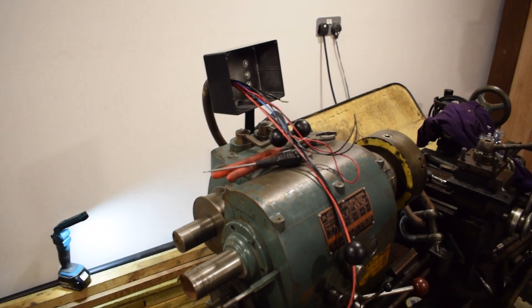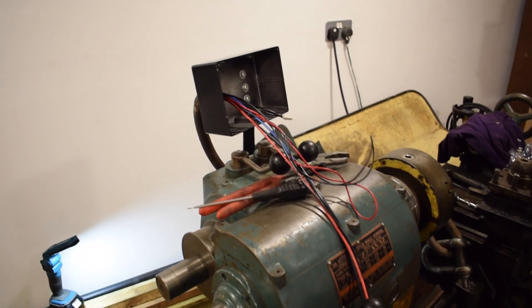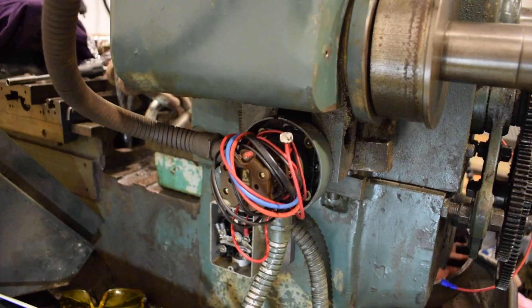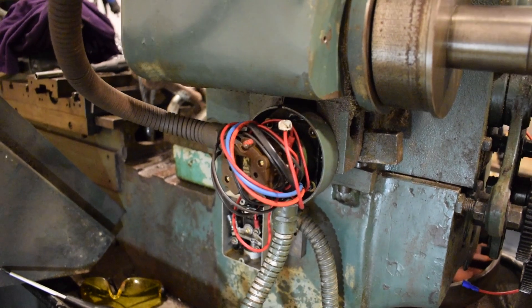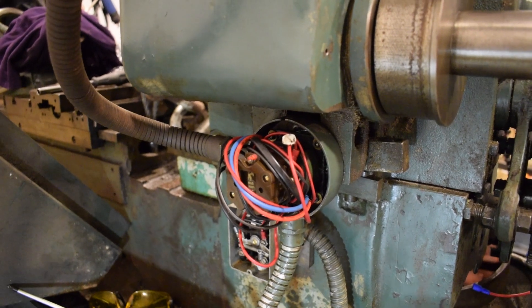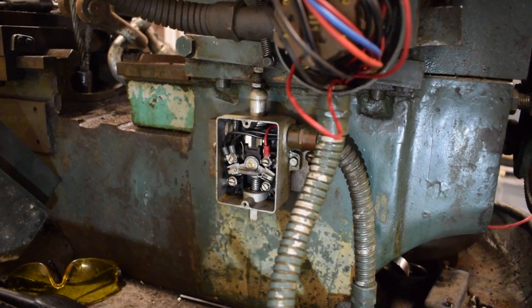I've got the control box on now with the cable feed — I've reused the old one from the pillar drill. I'm going to mount it into the switched area for forward and reverse on the side there, cut it down, fit it, and run all the cables. I know it looks really messy because it is — it's been a bit of a faff getting everything where I want it. The cables are now run from there down to the rotary switch. Everything apart from the two 230 volt lines are low voltage signal wires, and those 230 volt ones are tucked right out of the way so they won't rub on anything. Annoyingly I'm going to have to leave it there for this video, but next video in two weeks I'll complete the last bits and have it up and running. Thanks for watching!